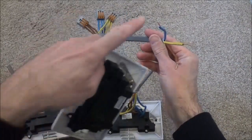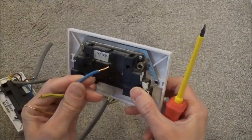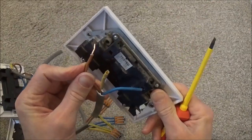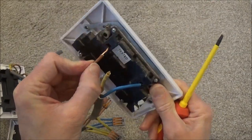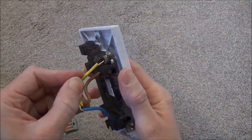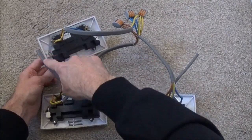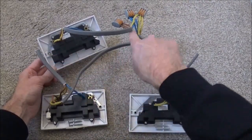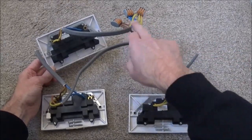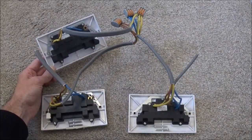Take your additional socket and connect these wires into the corresponding terminals. Place the neutral wire into the neutral terminal and tighten up. Place the live wire into the live terminal and tighten up. Place the earth wire into one of the earth terminals and tighten up. So now we've still got the original ring circuit continuing around the loop, but by using these connector blocks we've added this additional socket - so there is now one extra socket added to your ring circuit.